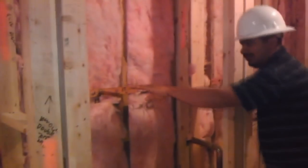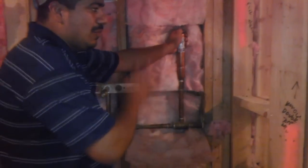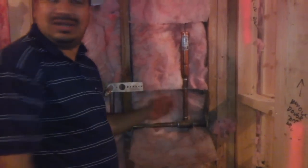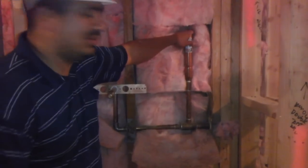So you can see all these urinals going to this line of cold domestic, and you put it towards the last of the fixtures. And what this is going to do is when you flush the urinal and the water comes rapidly over here, it will avoid the hammering and the potential noise or breaking your pipe.